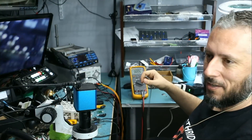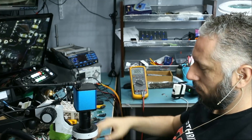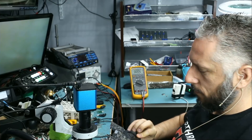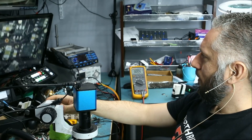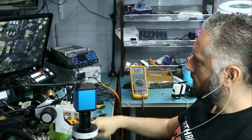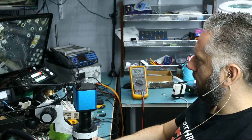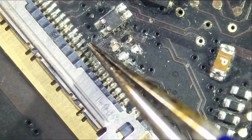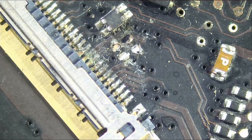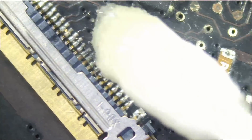We replaced the current sense resistor and the ISL chip, but I still have to replace the two capacitors that I took off before I started to record. We still have to test the board to make sure it turns on. As you can see, we did not have to do much measurements — just based on experience we figured out the problem.